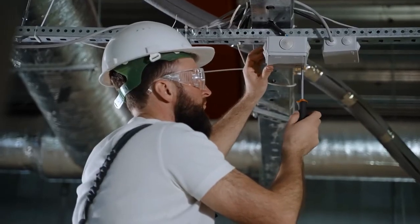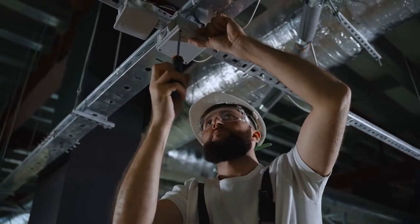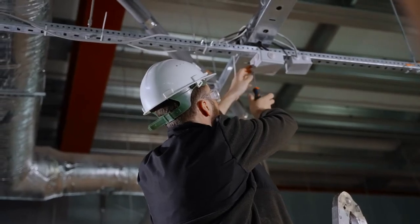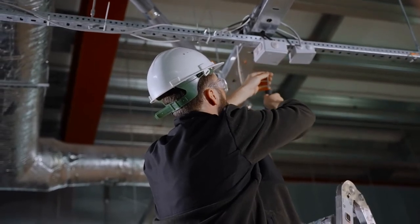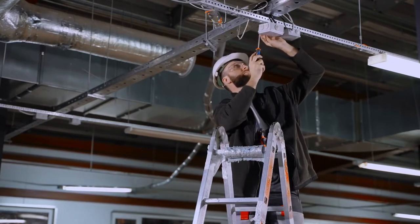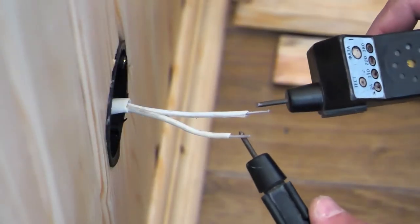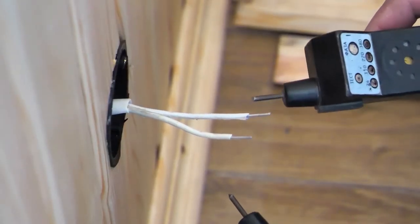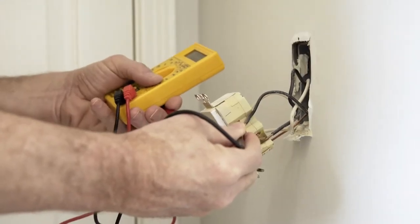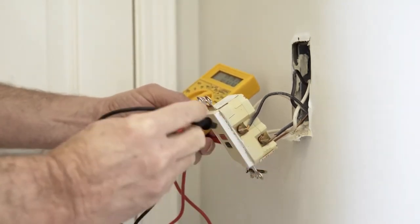If you're looking to add new fixtures, an easy hack is that you can just open up closed boxes. They are simply electrical boxes that have been covered up and painted over. They are usually pretty easy to miss, as they have become a good part of what makes up our environment. While we barely notice them, they do usually have live power in them, which is the reason for the cover, required for any boxes that contain wiring. The first step is to remove the cover and test the wiring with a non-contact voltage tester. These testers detect voltage through wire insulation so that you don't risk touching any bare wire ends.